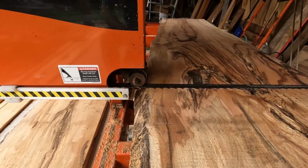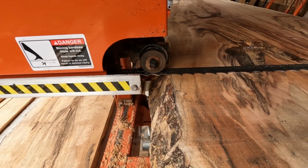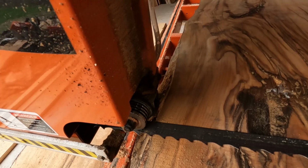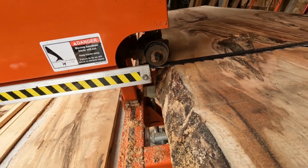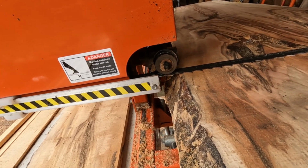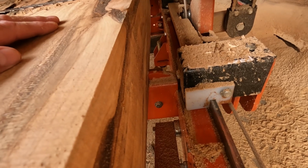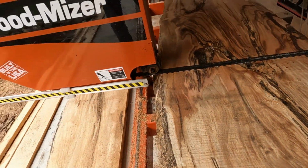Okay, here's where we're at. I brought the saw head down to its widest point, widest point of the log that is. And the saw is at the same level as the cut I just made. And as you can see, this corner of this bracket here, hopefully you can see that, just cleared that time. But as I lower the saw another 2 inches, it's going to hit down here where it starts flaring out. On the other side, I do have good clearance. And the log stops there on the bunks. That's right up against. That's good. But I'll travel over here.